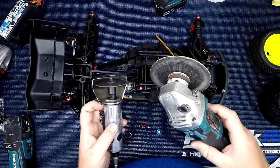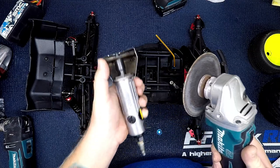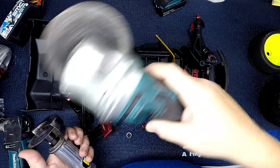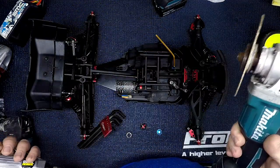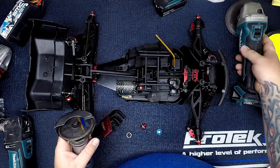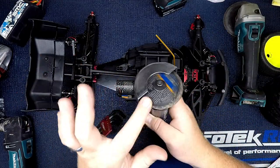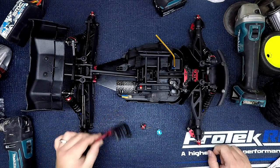My tool of choice for cutting metal is always some sort of angle grinder. Here's an air one for an air compressor, and this is my electric one. I love this thing. You may not have these, but you might have a Dremel — Dremels have cutoff wheels as well, and that's what I recommend using to cut these down. Don't use a Sawzall; you'll lose some fingers.